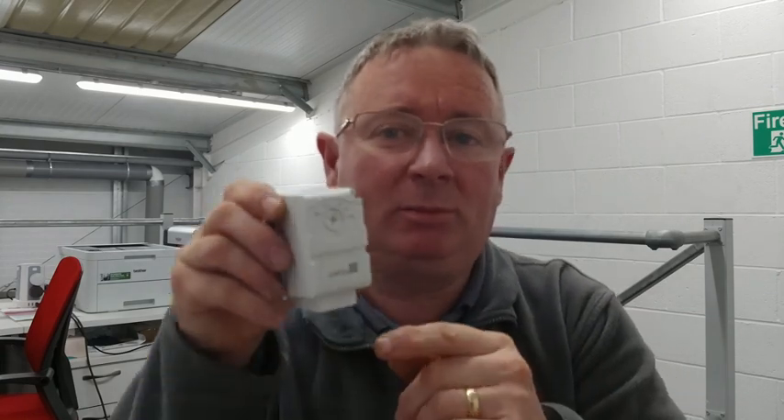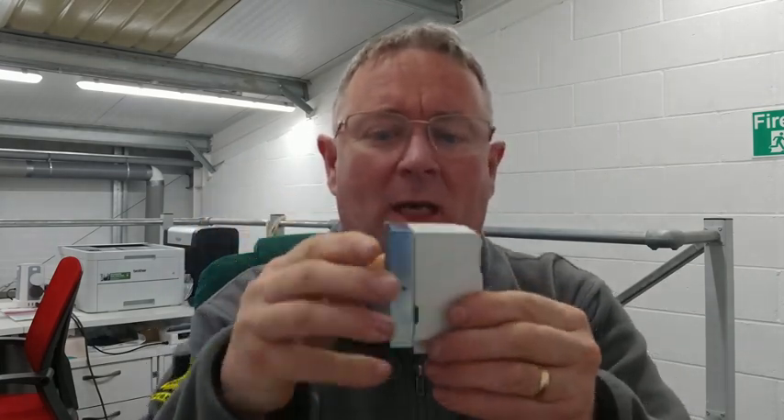The cable comes out the bottom and goes onto the cylinder. You offer it up to the cylinder, cut around the insulation, and get this part here touching the hot water cylinder. It's really important because you want to create this little cavity full of the temperature of the cylinder so you can get an accurate reading.